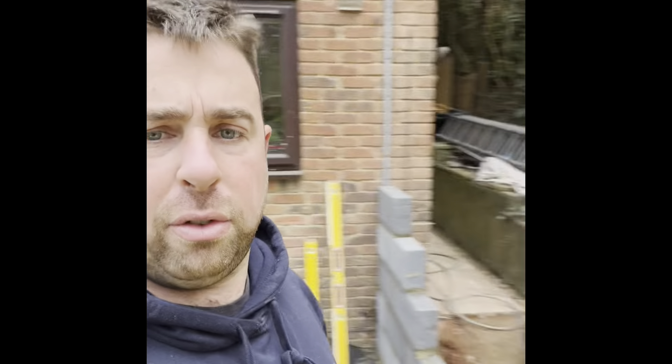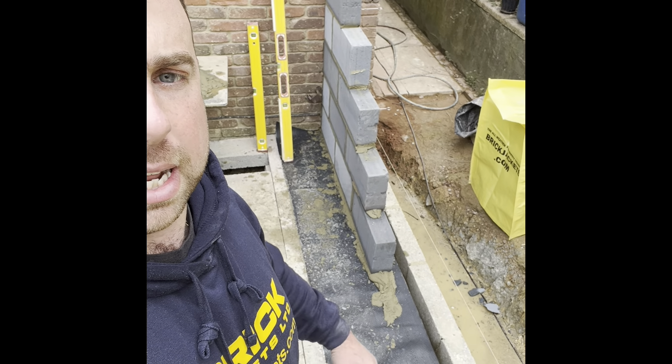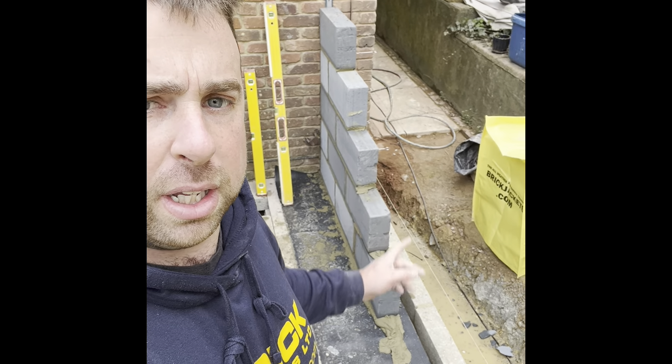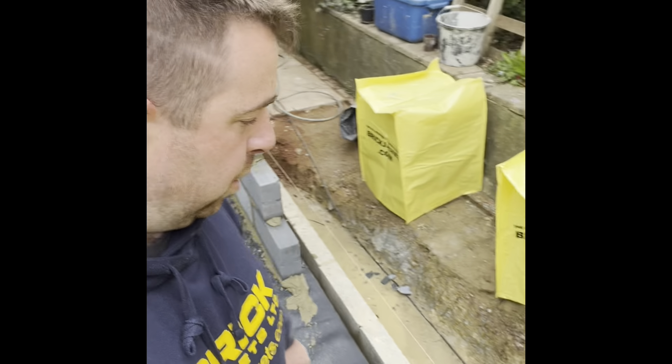Hope you've all had a good long weekend - three days but yeah, we're back on the ranch now. We've basically rolled out 18-inch damp on the beam, that's going to get lapped up on the inside before the insulation screed. Just racking up a corner now. I've pulled a string line through again flush with the brickwork, just through to a rope pin, so I can measure across from my blockwork to the line just to make sure the blockwork is running true for this end elevation.